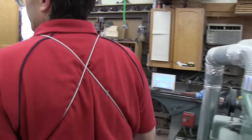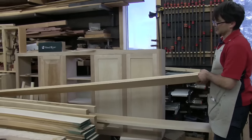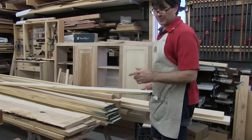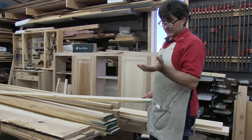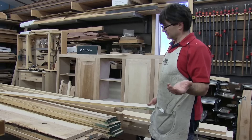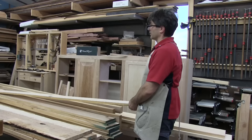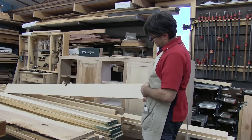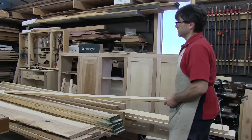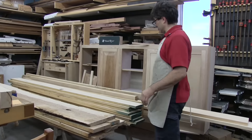Not that that's anything in particular. I also picked up some 5-quarter, and this is beautiful stuff too. It's really expensive when you start getting into the thicker pieces — clear northern white pine. I bought a bunch of 4-quarter maple. Now I normally buy my lumber rough because from the time you process it, it's going to twist and whatever. So if you buy surfaced material and you buy it at 13/16ths, chances are you're not going to be able to get it flat and still get 3-quarters. But he had a bunch of this stuff which is surface planed and it's down to only 7/8ths, so you still have an eighth of an inch in order to flatten it out. You can go through the pile and get exactly what you want without having to surface everything yourself.